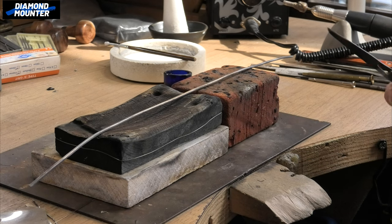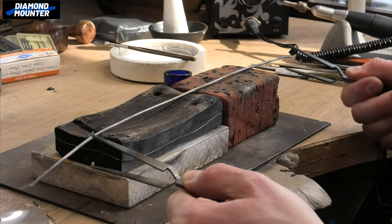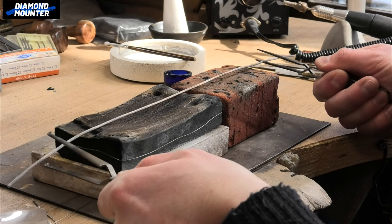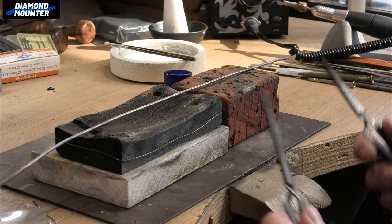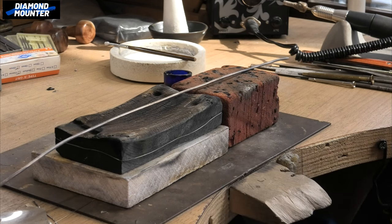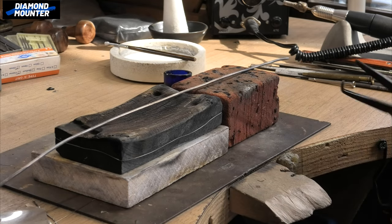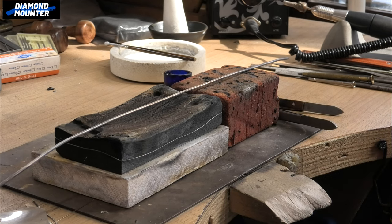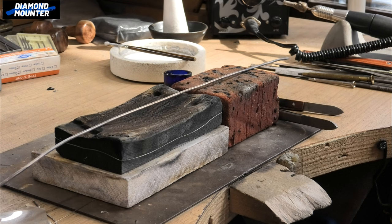Be careful when you're picking it up obviously. If it's really long and still heavy, it might be worth trying to grab it from two positions and work with it like that. If you're in a rush and really want to get it in the acid, cool it down with water first, then carefully put it in the acid. You don't want to be balancing red hot bits of metal near open containers of dangerous corrosive chemicals. Anyway, that's my little two cents on annealing and using a brick to extend your annealing work area.